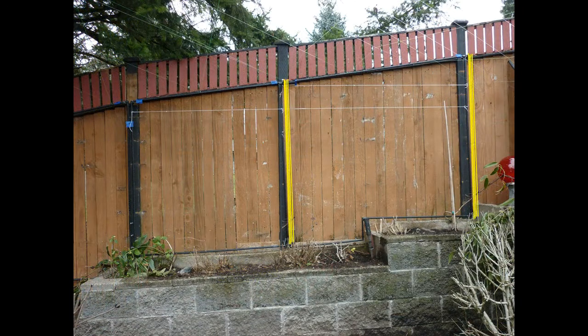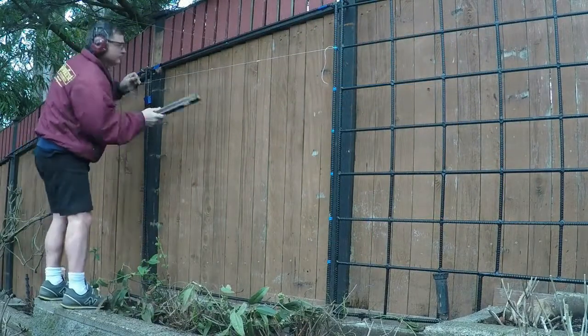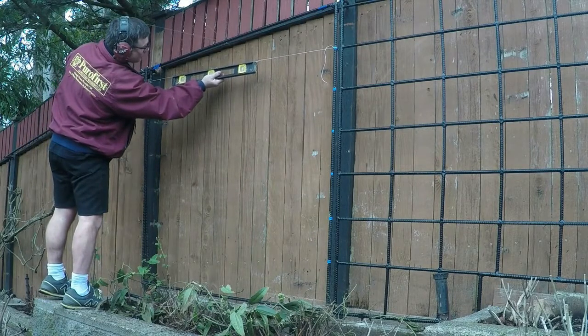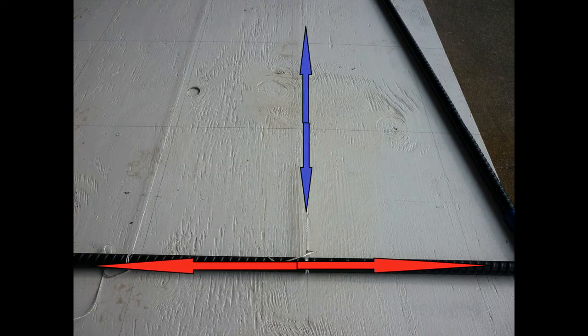We already know the left and right sides of the frames are parallel, so we don't have to do anything with those. But we do need to mark a horizontal line that runs perpendicular to the outside frames. To do this, we're going to use string. The string will be anchored at the top of the shortest side of the frame. Tie off one end of the string and run it to the other side of the frame. Make sure the string is level, and then tie it off to the other side. This job is easier with two people, because it's really hard to tie a knot with one hand. You're now ready to head to your template. Lay the two sides of the rebar that are parallel and weld directly on one set of lines, and your string will be over the perpendicular line. You're now ready to start cutting and welding.